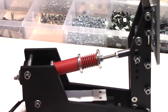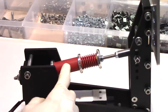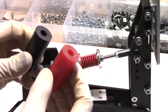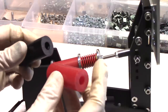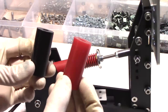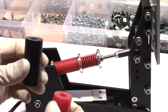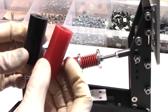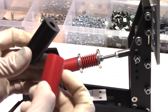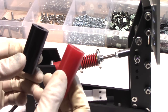This plastic tube is designed to stop the brake pedal before the spring compresses all the way. Once you've pressed the brake pedal far enough and hit the plastic tube, you've engaged the polyurethane bushings. The red is the softer bushing and the black is the harder bushing. We've given you two extra so that you can use either two red ones, two black ones, or a black and a red — you can mix and match depending on what feel you're going for.